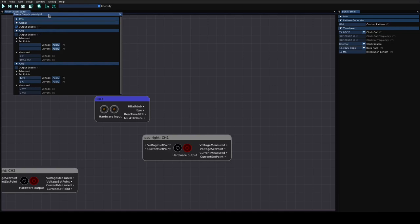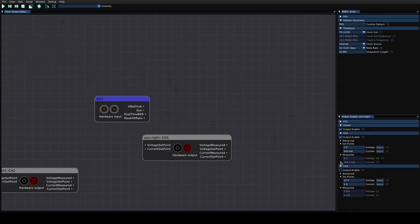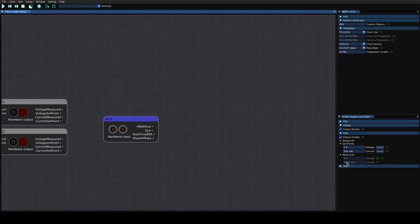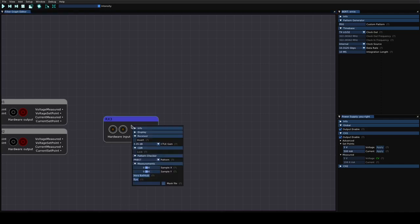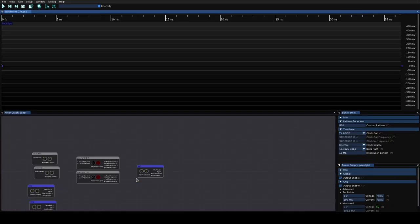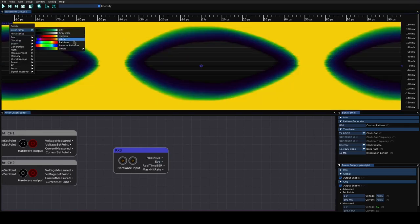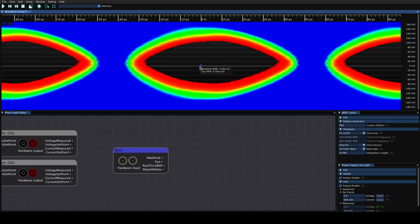The de-emphasis here is interesting because it's not an FFE or tap-based structure but a purely analog RC-based circuit that provides a little bit of boost on transitions regardless of the data rate. So it looks a little different on a real-time scope, and I'm curious what it'll do in the BERT. Back in NG Scope Client, we're connected to the BERT and adding the power supply controlling the board — we're pulling about 194 mA at 5V. The receiver is not locked initially because the test board is outputting PRBS 9 and we're telling the BERT to look for PRBS 7. Switching to PRBS 9 gives a quick lock, and pulling an eye pattern through the 150mm low-grade FR4 channel with no emphasis looks actually more open than expected.